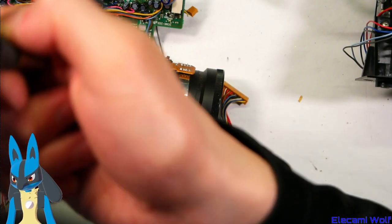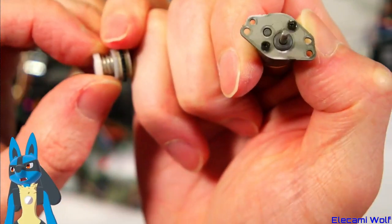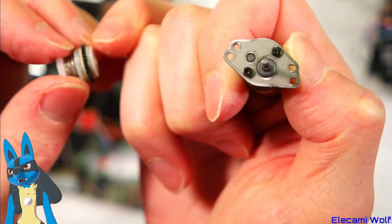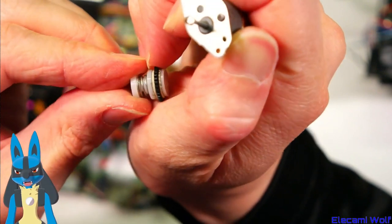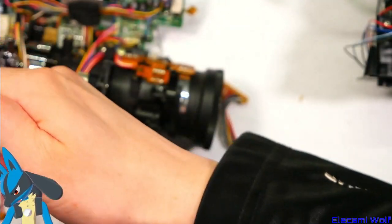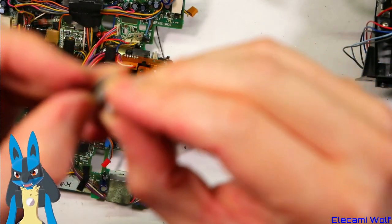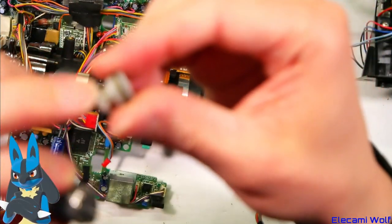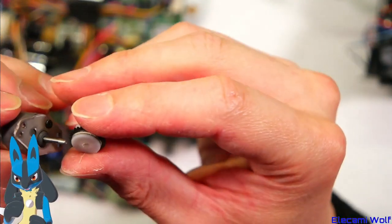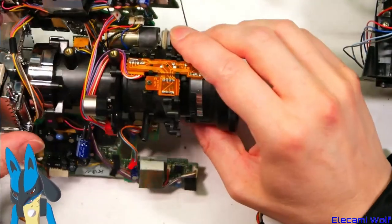I don't know why that happened, because normally you can't back-drive these gearboxes — they've got a little clutch thing. On the output shaft there are two little felt discs compressed with a spring against the motor output pulley. So if you're applying too much force to it, it will just slip there. Maybe that's jammed. I think it might have jammed up. The little clutch thing appears to be full of glue or something. That must be why the motor got wrecked — because if you pull on the zoom lever and this clutch thing doesn't slip, then you'll end up munting it, applying a lot of force to the little gearbox.